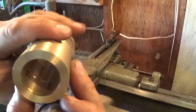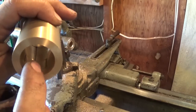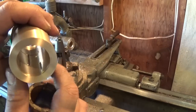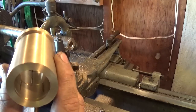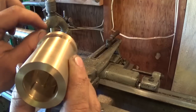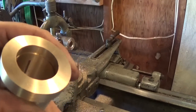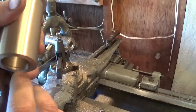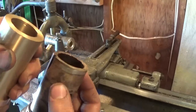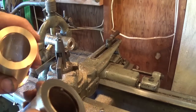You can see those are now my oil channels. I haven't cut the center notch here yet - the notch would be right in the center. I've just cut these grooves with the boring bar by holding the piece stationary and running the lathe carriage in and out, progressively backing the cross-feed out to allow the cutter to dig into the bearing and take nice light cuts to scrape away a groove. And then there's the oil drain groove - it's about 15 to 20 thousandths deep, about the same as the original.